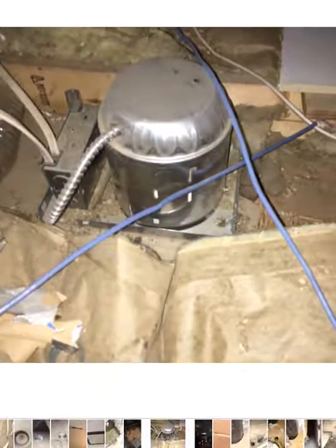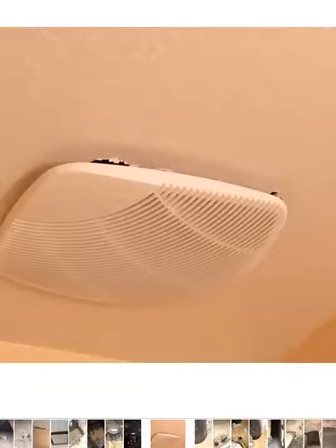Here's a can light — perfect example of where it needs to be sealed around the floor joist right here. The next picture is going to show you how much of that is coming in. I turn my flash off, the lights are on — you can see how much room there is for heat to penetrate through that into the home. Dirty air can go into the home. So when that's properly coned and sealed, that becomes a non-issue or really minimizes the issue anyway.